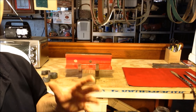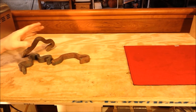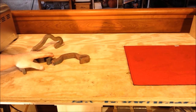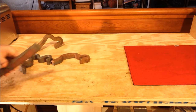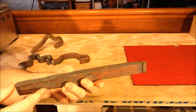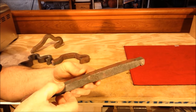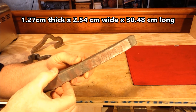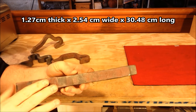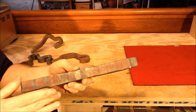So now I'll take you through the process of how I made the blades. The first step was to take these rail anchors and straighten them out at the forge. What you end up with is a straight bar — about half an inch thick by one inch wide and about 12 inches long. They're not easy to work; I use the power hammer to bang these out.